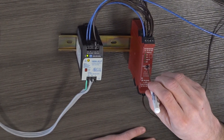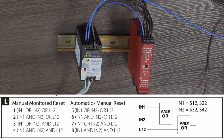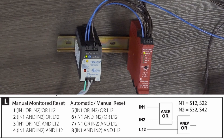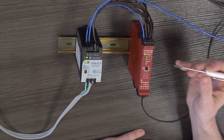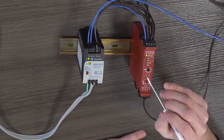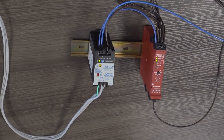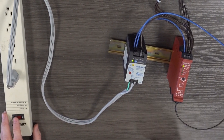For this application, we're going to go to dial setting two, which means if either one of my e-stops is pressed, it will shut the machine down, and there's also a manual reset as well. Right here on the input one LED, you can see it's flashing twice — that is confirmation of your dial setting. If I were to set this to dial setting six, this input LED would flash six times. I've confirmed I'm in dial setting two. Now all I need to do is power cycle the safety relay one more time in order for that configuration to save.